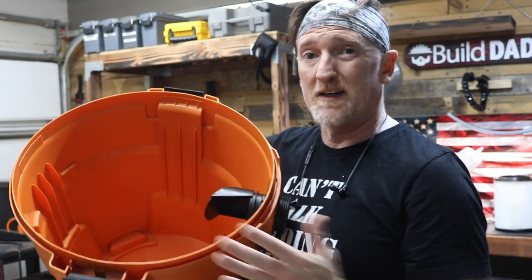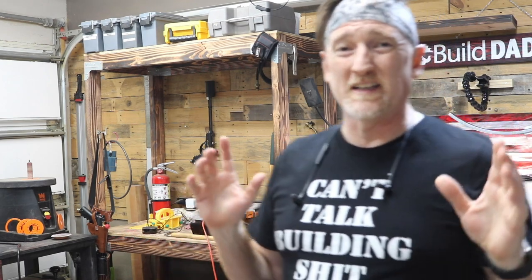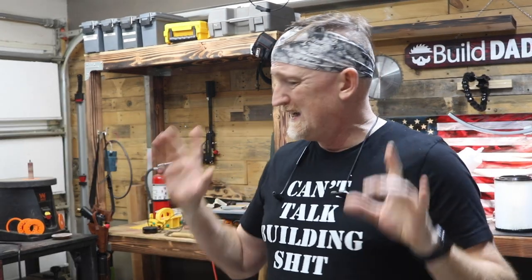So normally, next thing I would assemble this, but I'm probably not gonna put the feet on it. I don't know if I'm gonna put the handle on the top. I don't know if that's necessary. Maybe, maybe not, we'll see. We're gonna take our measurements off the top of the bucket because that is the biggest circumference that we have to deal with. Is it circumference? Radius? Circumcision? I don't know. It's the big part. Also, most of the builds, they were making the entire thing out of 3/4 inch plywood. I feel like this is gonna make it heavier than it needs to be. I do have this piece of 3/4 that's left over, so I'm gonna use that for the bottom. But I think I'm gonna make the rest of it out of 1/2 inch.